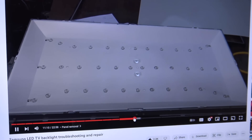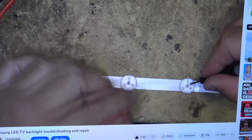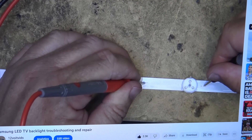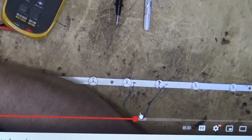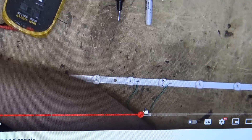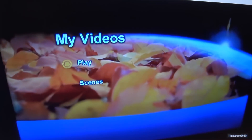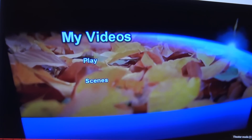Here's our array of LEDs. Testing with the meter, there's the bad LED on this one that we're going to bypass. Jumper wire in place, going to reassemble this set. Now remember this is five years ago and I still have this TV and it runs constantly. Here's the set after reassembly — everything is looking good.